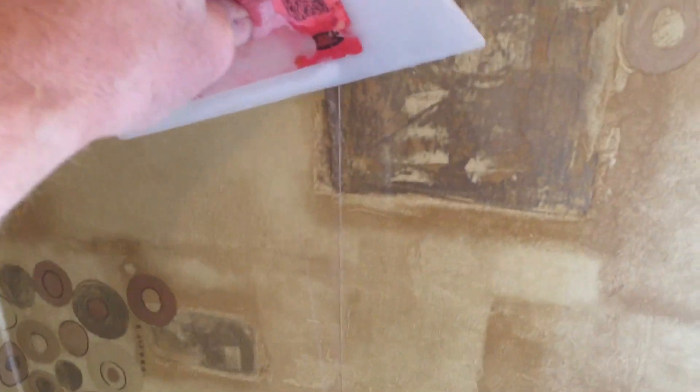If you just put the glue in without wetting first, even with the best seam repair adhesive, when you press it down it keeps coming back up. You could use wallpaper adhesive — isn't that what it was hung with in the first place? Once I'm convinced the backing has absorbed enough moisture, I take a regular plastic smoother and push that seam back into place.